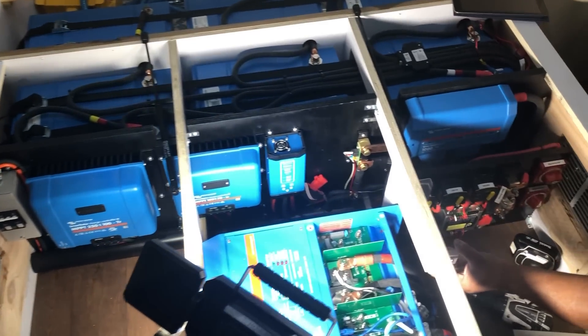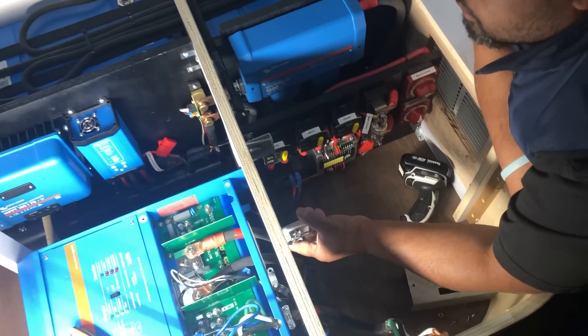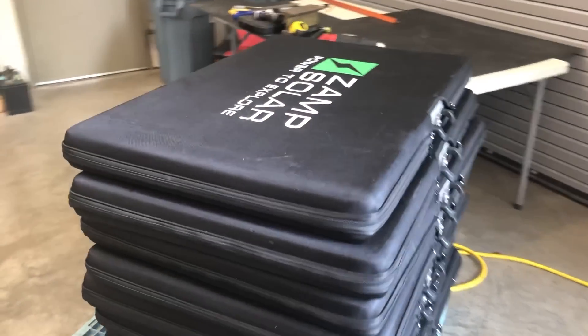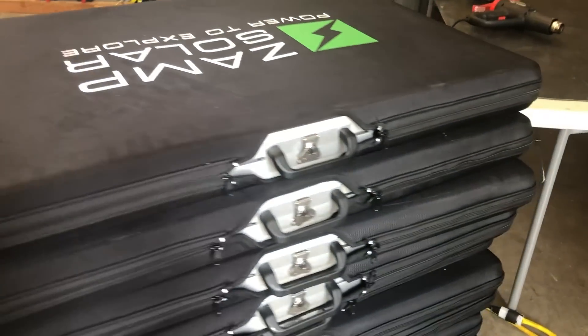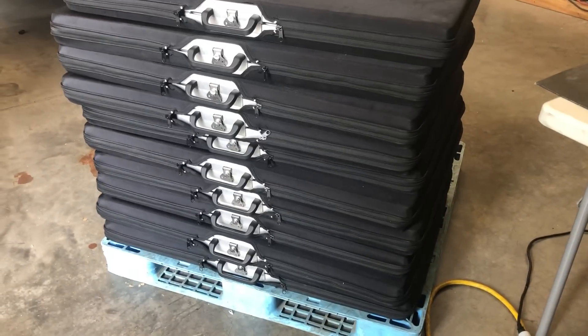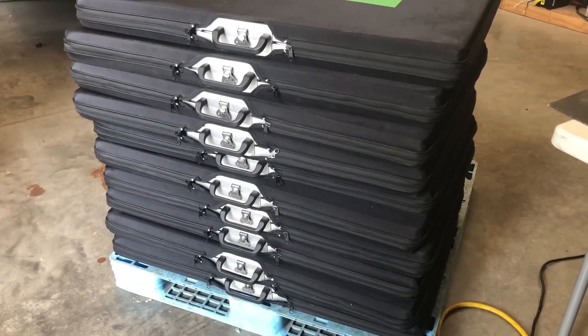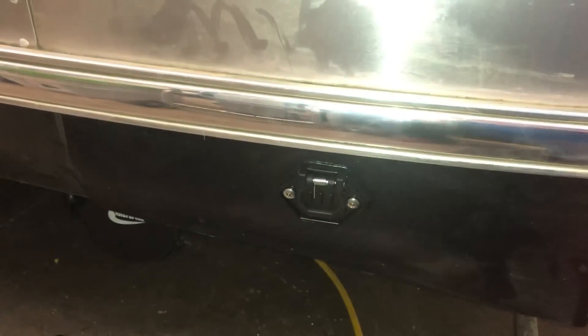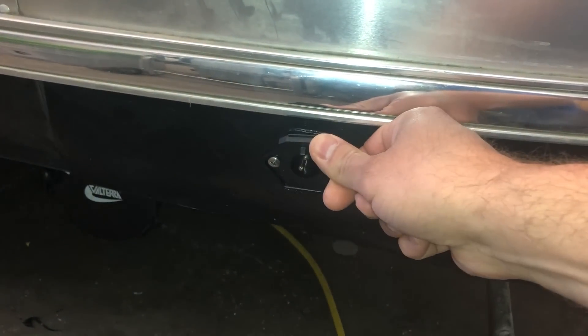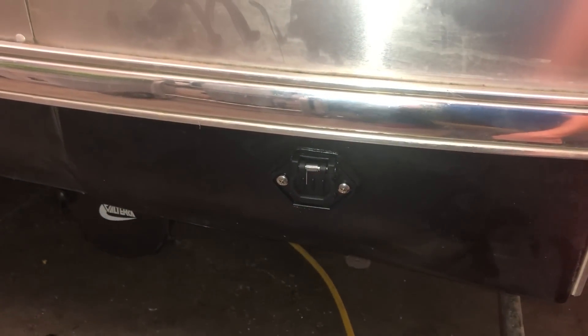Alvin and James are back here doing some final touches installing a DIN rail breaker. The ZAMP folding panels are all stacked up — all 10 of them, 230 watts — and they've been modified to work in series with the Victron 100 amp charge controller. Here's the port — just one port, very incognito — all 10 panels connect right to that.